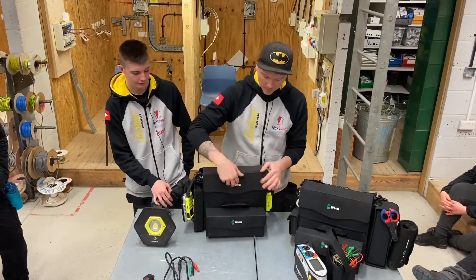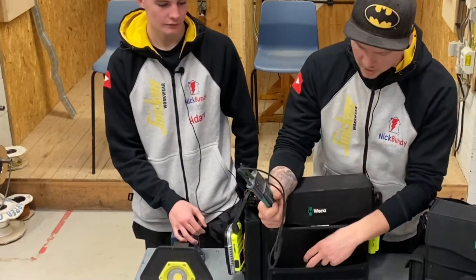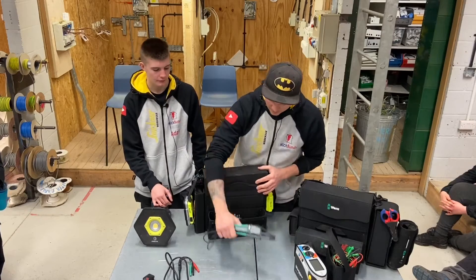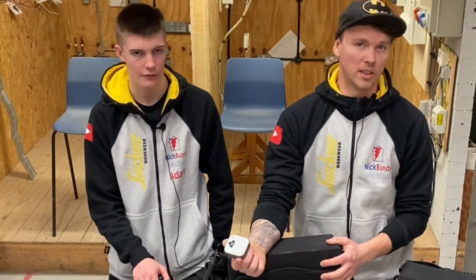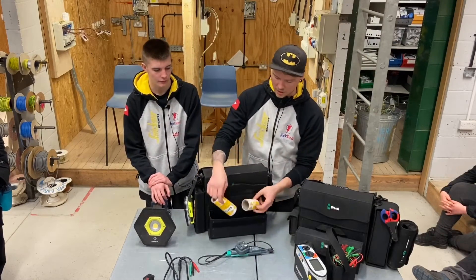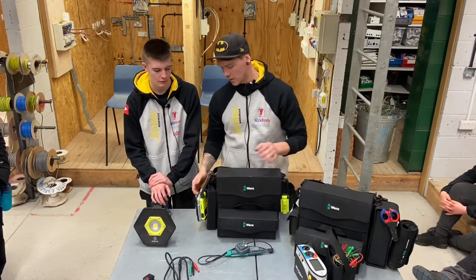On the front we've got just an extra compartment. We've got a voltage tester. The proving unit is actually somewhere else, as is my locking off kit — that should be velcroed to the side. Plug top tester, mainly just to find out what circuit a socket is on. And a couple of labels — there are a few more labels to go in here but we need to restock. Mainly for fuse board changes or EICRs — the usual stickers that need to go on.